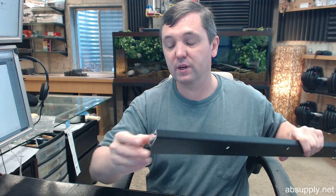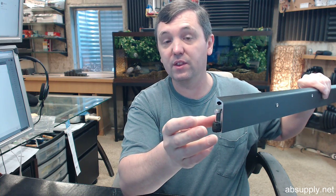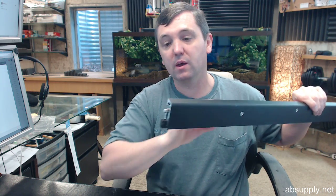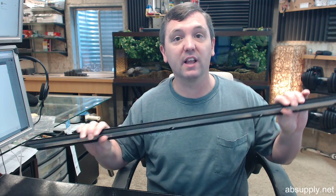The reason it has to be mounted on the push side of the door — and it can't be mounted on the inside of a residential door that swings in — is because this drop bar, this plunger, needs to make contact with the frame and in this instance with the stop. When this item is attached to the face of the door, the drop bar will make contact with the stop when the door is closing, it will be forced in, forcing the bottom to drop.